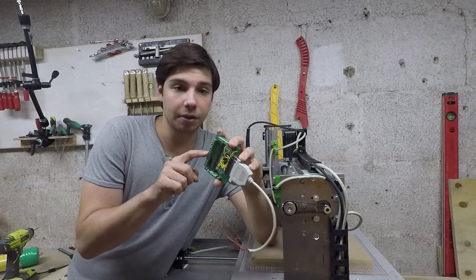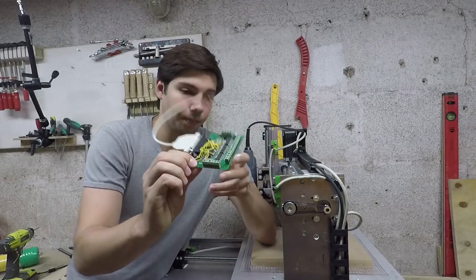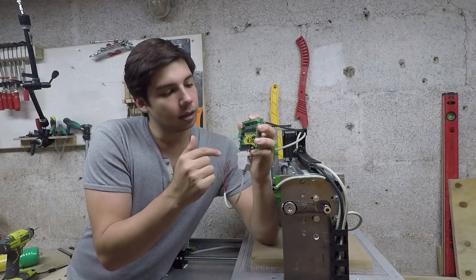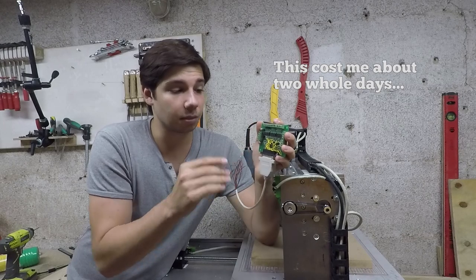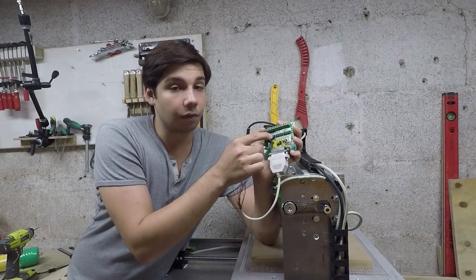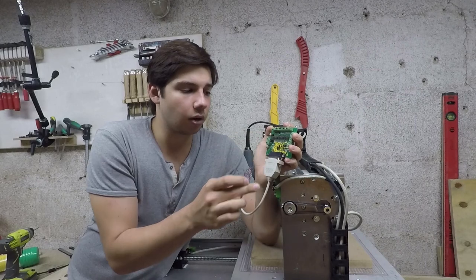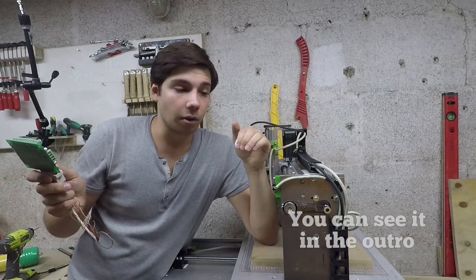My first problem was this breakout board — it came with a kit, it's undocumented, and you can't find any datasheets using the number on it. I tried to reverse engineer it: look up the traces, see where they went. It's pretty obvious the inputs go to the optocouplers, but there were also two inverter chips on it for some reason. I couldn't get it to work, so in the end I just jumped wires directly from the input to the optocoupler inputs. That kind of worked, but then the limit switch signals didn't work properly. So in the end I tossed the whole thing, made my own circuit, and that's working really fine now.